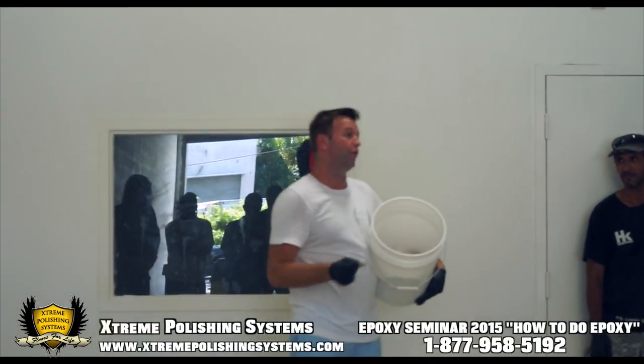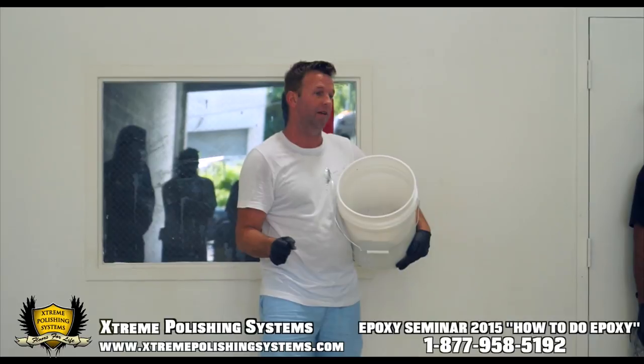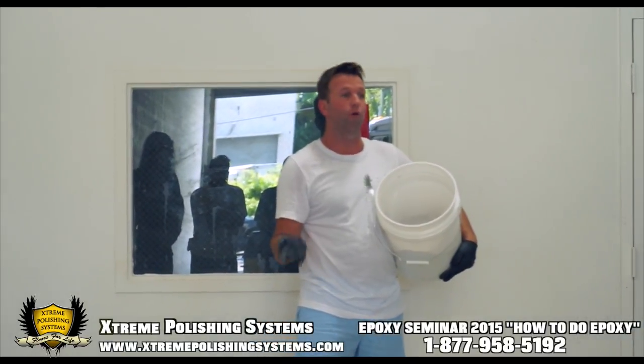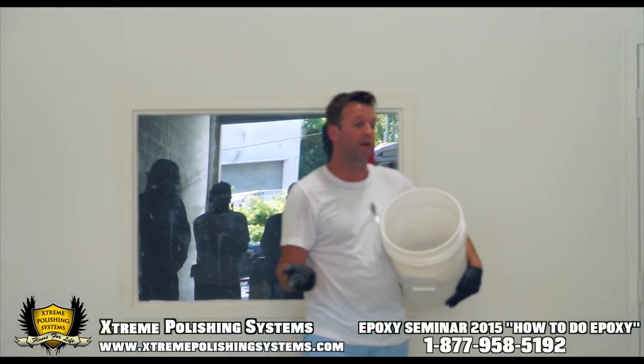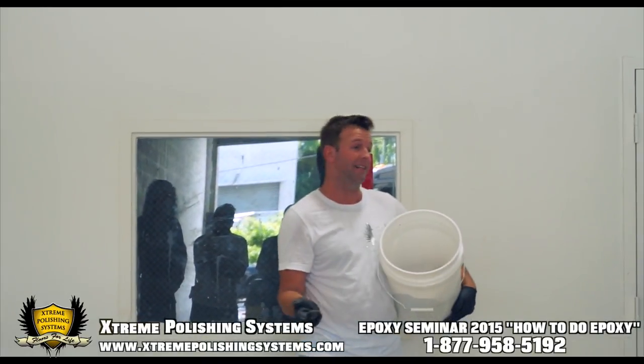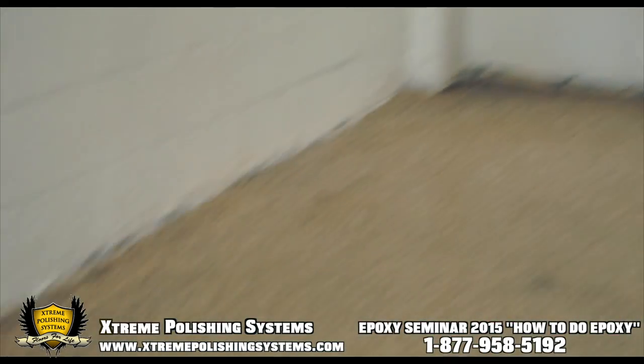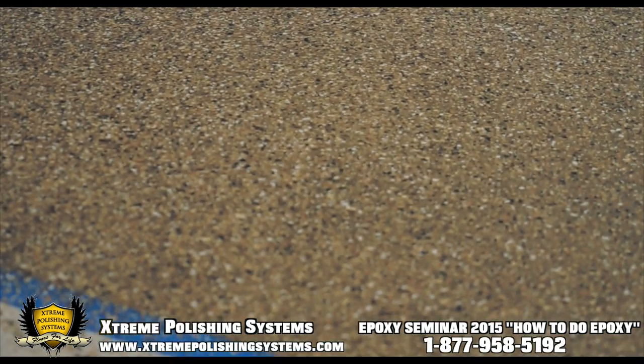For full coverage, flake is usually 10 pounds per 100 square feet. So if you have a 2-car garage, 400 square feet, you would roughly need 40 pounds of flake to do a complete broadcast. Smaller flake takes more, because there's 1/8 inch, 1/16 inch, and this is 1/4 inch. So the smaller the flake, it might take a little more for coverage.